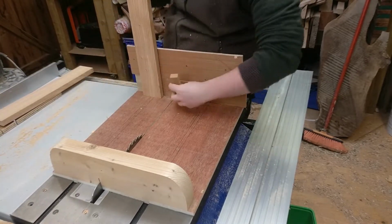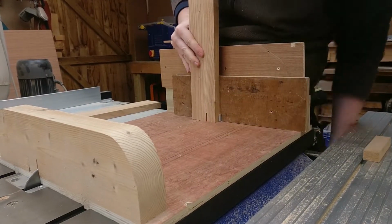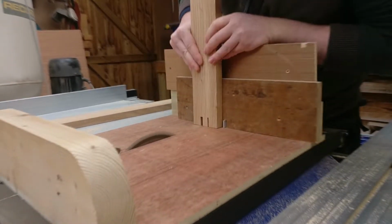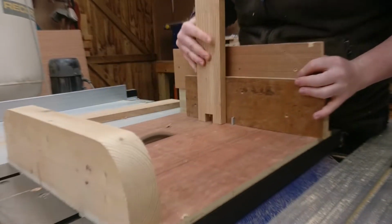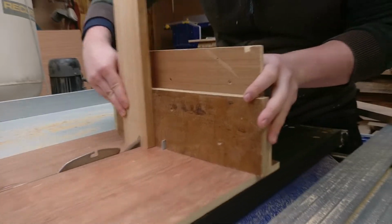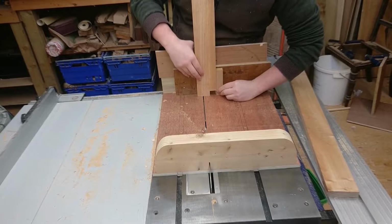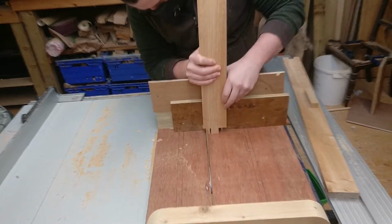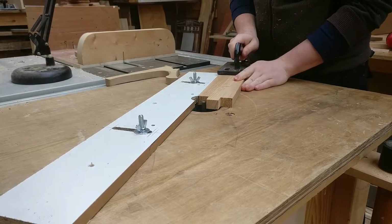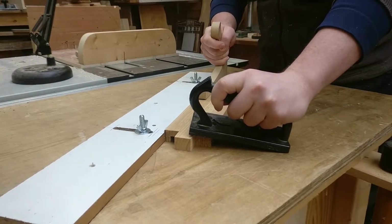First up for this video is the lid. I used the same box joint jig to create the frame of the lid as I did for the rest of the carcass in the chest. I then used a makeshift fence on the router table to create a groove that I can put the panel for the lid into it and basically assemble everything together with that.